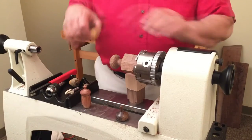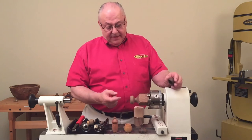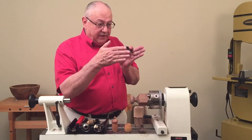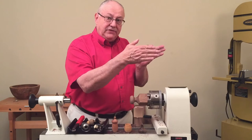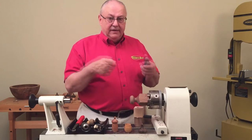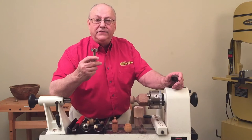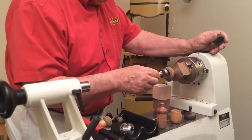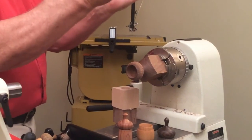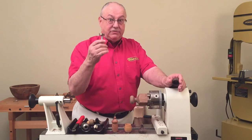The acorn has a cap and a nut. When we're making the cap, the main issue is that the hole in there needs to have sides that are cylindrical — they need to be parallel. I always struggled with that with my normal lathe tools. Finally, I was looking at a Forstner bit. The sides are absolutely parallel. So when I drill this, I know the lid's going to fit. If they're curved in or out, the lid is never going to fit right. A Forstner bit solves that instantly and it's really easy.